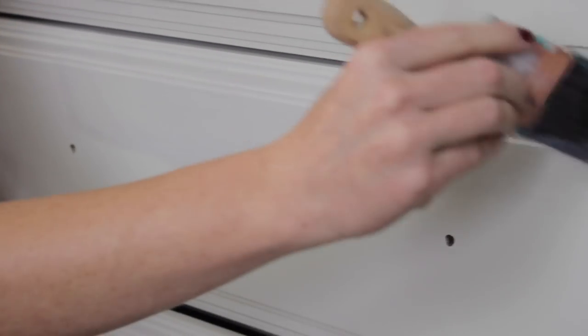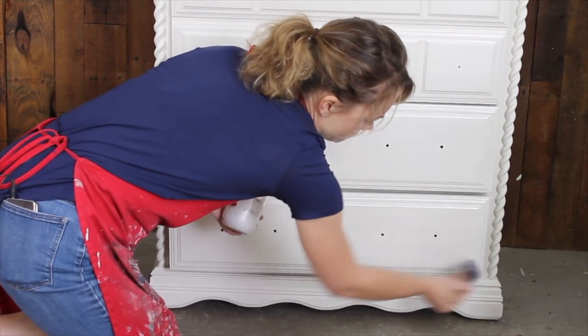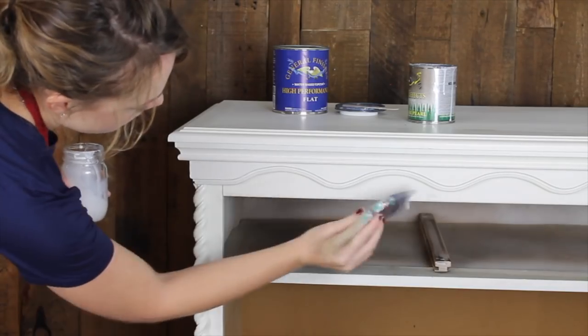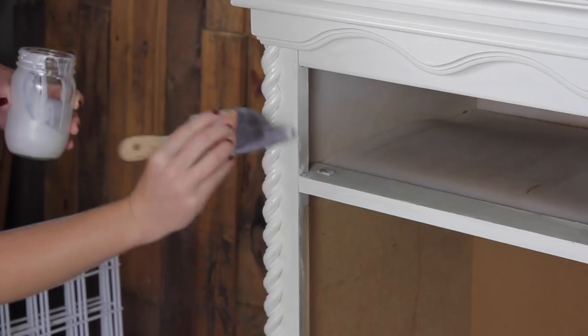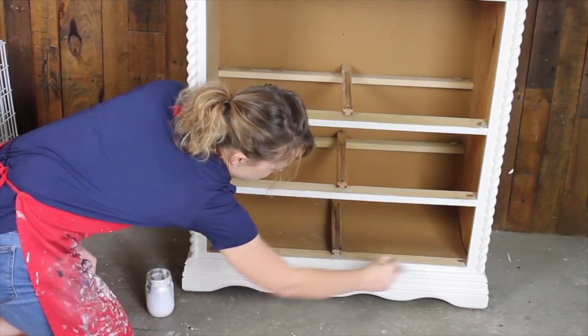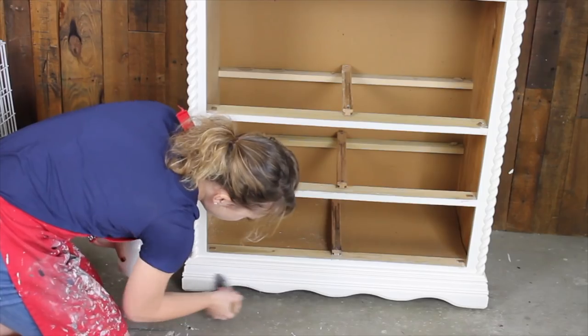What I didn't mention earlier — we were starting with a painted piece here. This was two coats of antique white milk paint. I did not seal it with any additional top coat before applying the pearl. Each coat of metallic finish will take about two hours to dry. If you'd like to add more metallic you can do an additional coat just like this. Since we've mixed in the top coat with the pearl effects, I don't find it's usually necessary to do an additional top coat. However, if you're trying to increase the glossiness or want some extra protection, you definitely can.